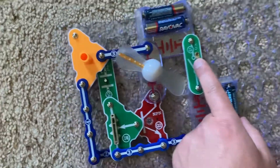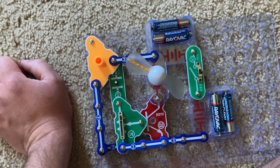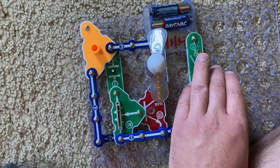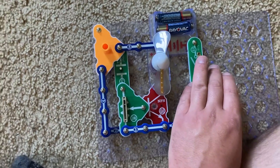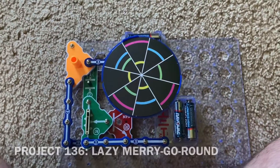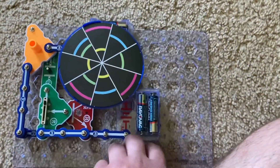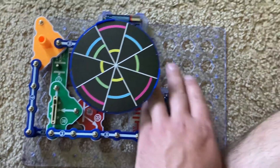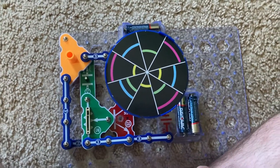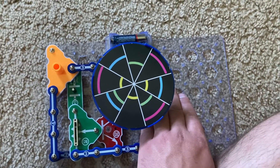Turning on the slide switch turns on the fan and charges up the C4 capacitor. Turning off the slide switch will cause the capacitor to discharge, which takes about 20 seconds. I replace the light motor with the geared motor and merry-go-round, and I'm going to turn on the slide switch. The RV2 stays on the same setting. When I turn on the slide switch, the motor and merry-go-round briefly spin and then stop. Same principle, just using the merry-go-round and geared motor this time.